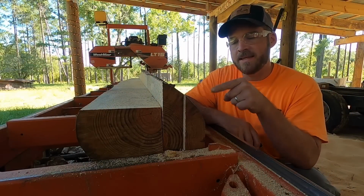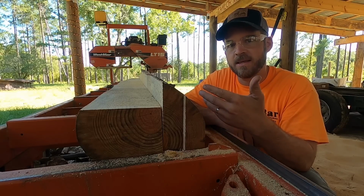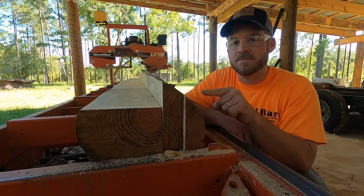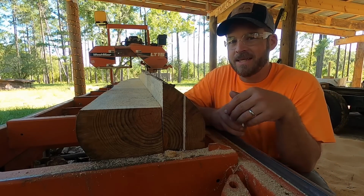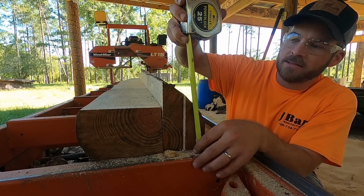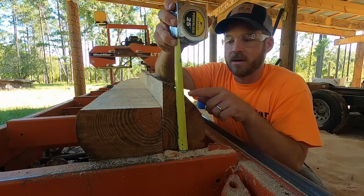I'm doing the same technique on this log as I was doing on the other ones, just to maximize what I can get out of the log. But it's looking like I'm going to be able to actually get some 2x6s out of this one as well, instead of all 2x4s. I was after 2x4s, but it wouldn't make any sense to chop these down to 4 when I can actually get at least one decent 2x6 and one with some wane on it as well